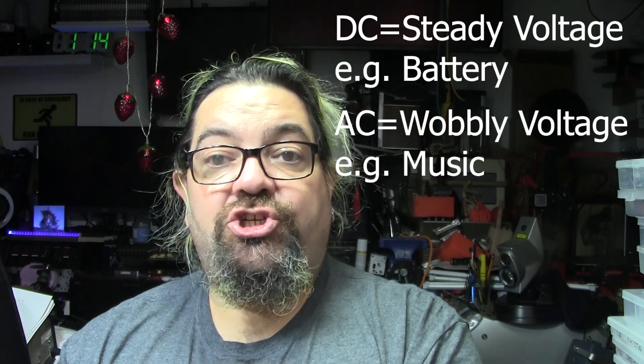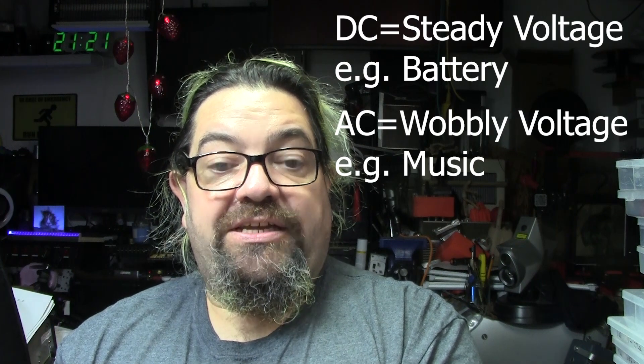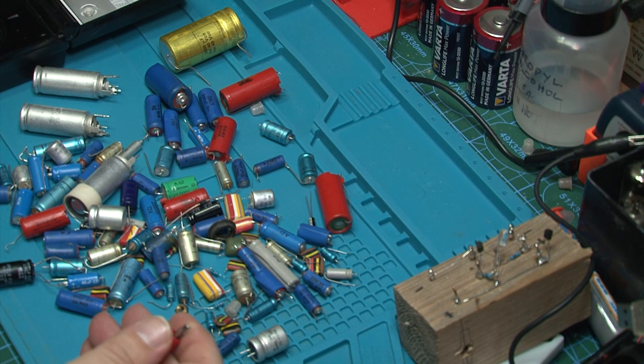What we need to do is put some form of DC blocking in. Now a capacitor should block DC. AC would get through, so if we put an audio signal through the capacitor, this would measure audio current if we switch it to AC. But we're trying to see if the capacitor leaks — and when I mean leaks, I mean leaks DC through the capacitor, which could affect the next stage in the radio, amplifier, telephone — anything with capacitors that are designed to block DC should block DC.